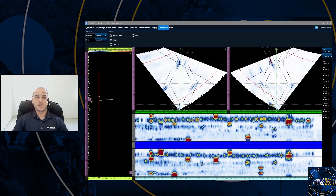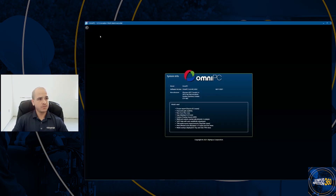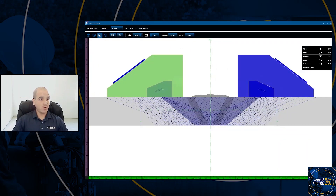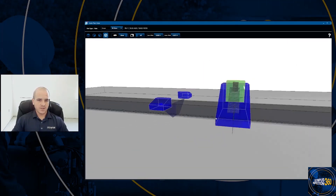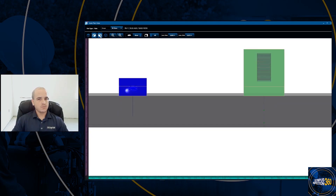Now that we've covered the key MXU features, let's dive into OmniPC. Just like the MXU, under preferences and system info you can get a list of all new features. I have a weld top inspection open — a dual group A32. New in OmniPC under the view tab and scan plan, we can see the scan plan that was previously only accessible on the instrument itself. We can get a 3D view of the part, see scan and index offsets, see our coverage, and even see the coupling check channel for a zero degree. You can also toggle top view, end view, and side view.